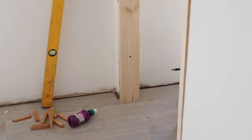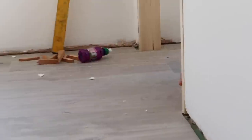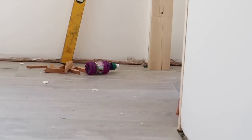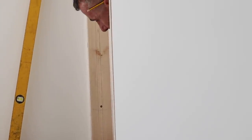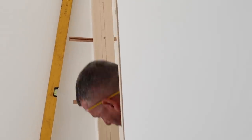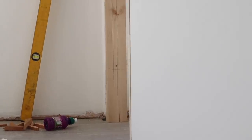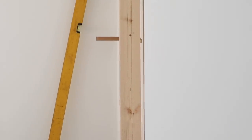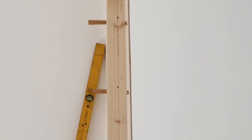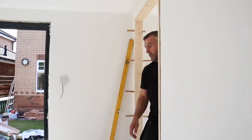The way we do that is, don't let John quite see this, because you need to stand back there, John. Right, I'm going to get that corner of the frame in line with that corner of that frame. And then what he's going to do is look up, and that gap there should be parallel with that corner of that frame there, all the way to the top. And then if it is, then you know that your door will shut, lovely. Right. Okay, just stand there.